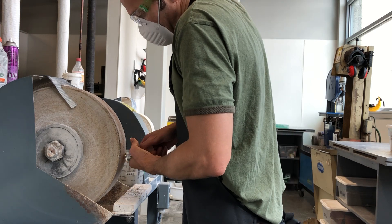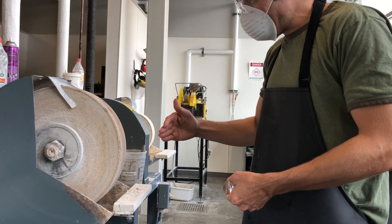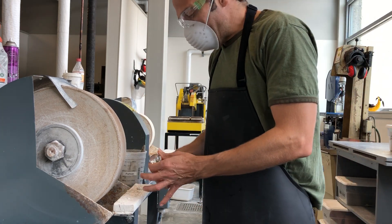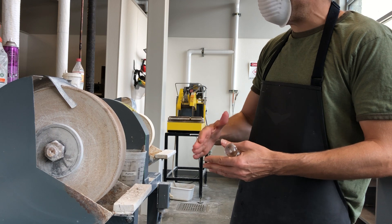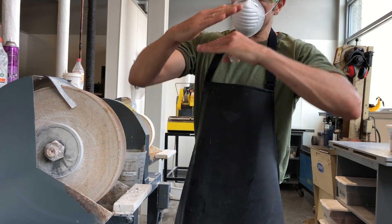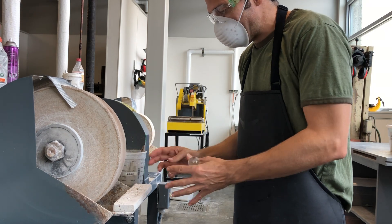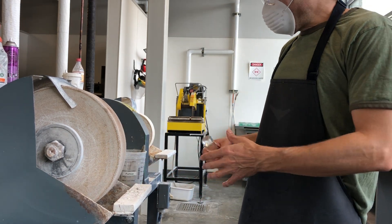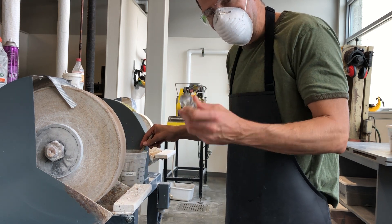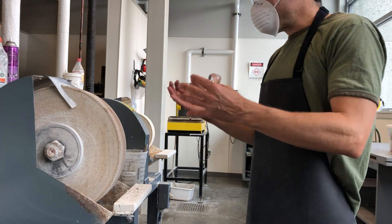I'm always supporting it underneath, turning very quickly, and I'm going to use the whole wheel. What I don't want is to stay on one spot, because I am wearing down the cork as I'm working. I want to work back and forth so that I'm wearing the wheel down evenly to keep a flat surface. If I was working on the bottom of something large that was flat, I don't want my wheel to have a little dish in it where I can't touch the bottom of a flat piece. So I'll make sure I'm working on the whole thing. I'm also going to immediately add more pumice as soon as the pumice I've applied is rubbed off — otherwise I'm just pushing glass against cork and nothing is happening.